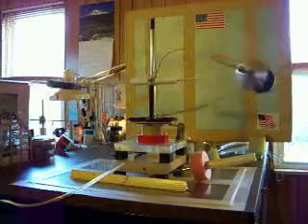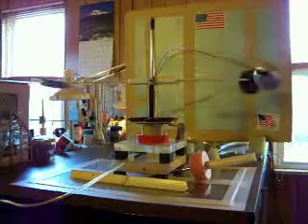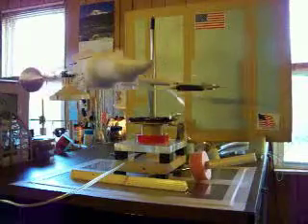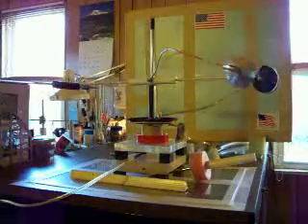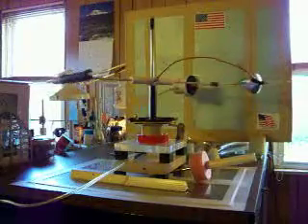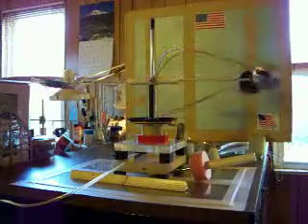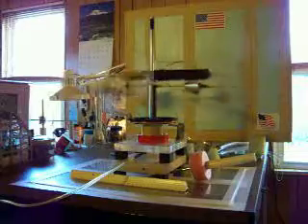As you can see it did pick up on its own — started by itself. I have had it up to 20 RPM but all day long I've been playing with this thing and I can't get it over 15, which is okay. About 24 inches a second velocity — that's the best it's getting. For the last week we've had very low humidity. I like to run these between 45 and 60 percent humidity, but it's just not there. The highest humidity today was 42. It's doing okay now — moving along at about 4 RPM I would think.